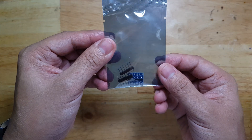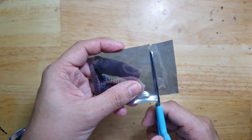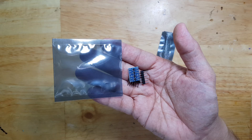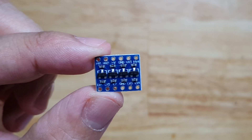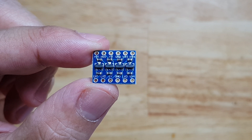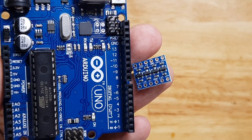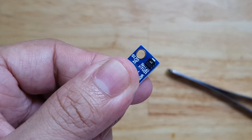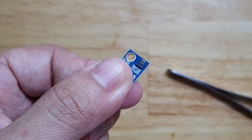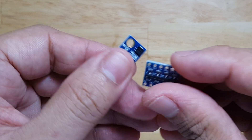In this video, I'm going to show you how we can use this Logic Level Shifter module. This module is used if we have to interface 5 volts from an Arduino board — where all pins are 5 volts — to some modules that require 3.3 volts, like this SHT21 temperature and humidity sensor which operates on 3.3 volts. This will be handy for that.